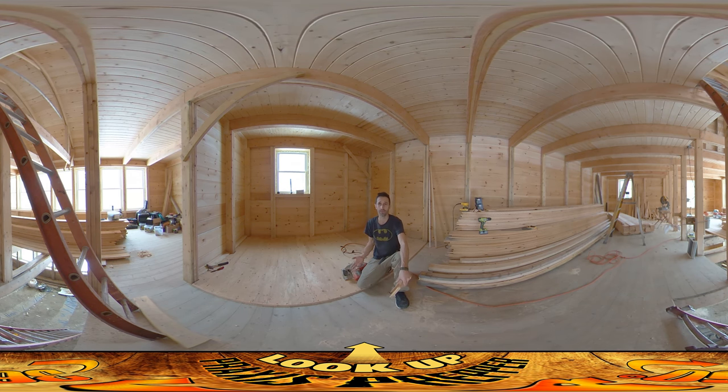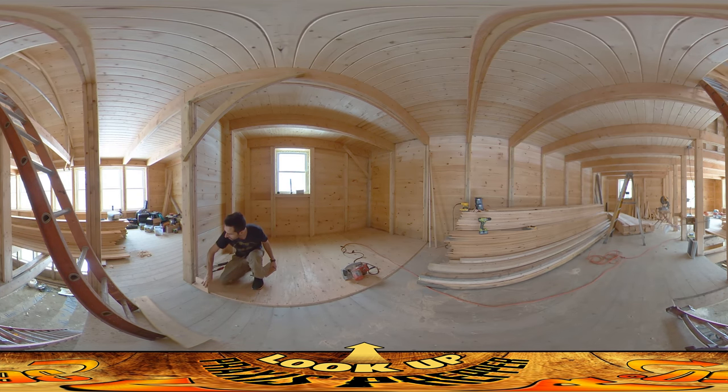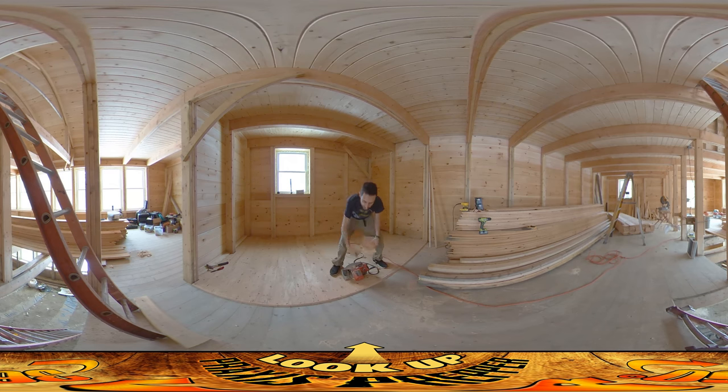That's not a big deal — that's a great thing about carpentry, it's easy to change things after you've done them. So I pulled all the screws holding down the areas of board I want to pull up, and I'm going to be cutting into it. While doing that I also realized I'd like to change where I'm going to terminate this wall. Initially I was going to have the wall boards go right across this post here, but I'd really like to have them terminate before the post so you still get to see it — it's a nice architectural element. So while I'm cutting out the door area I'm also going to cut back about three quarters of an inch to set the wall boards in just a little bit.